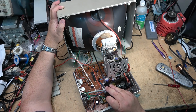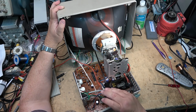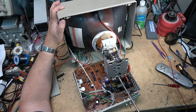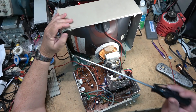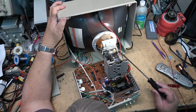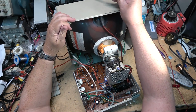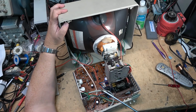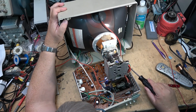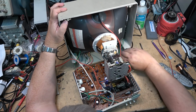You notice I'm supporting the cabinet so that the tube can't tilt back, because it could make contact with the flyback if it were to, with the cage here, and damage the picture tube. So I always have to keep a hand on the set itself when you're working on these sets, because they're not that well balanced,